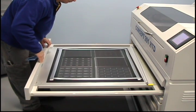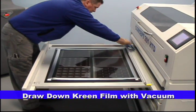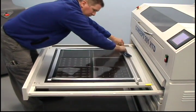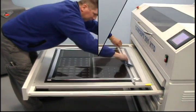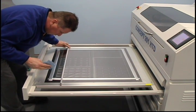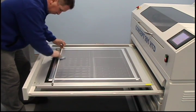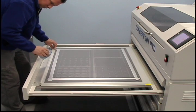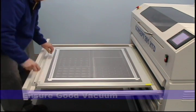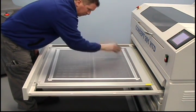The next step is to pull down the cover film. As the mylar vacuum sheet is unrolled, it is important to continuously wipe it down to remove any dust or debris. It is important to always wipe in one direction so as not to drag dust or debris back and forth across the sheet. Inspect the surface for a good, tight drawdown. If you notice any high spots, bubbles, or any other irregularities, be sure to correct the problem before exposing.